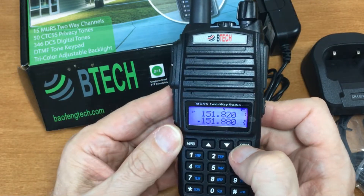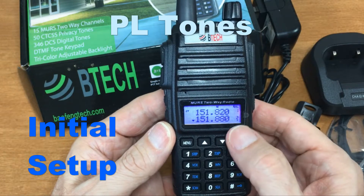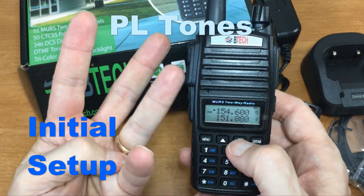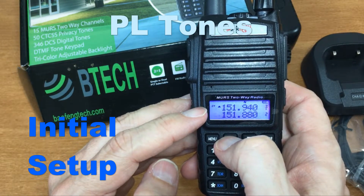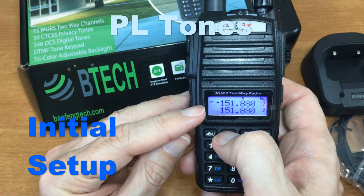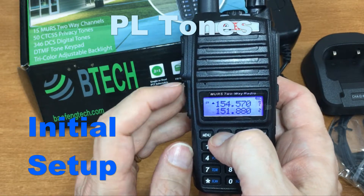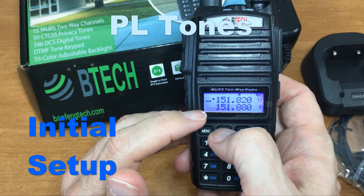Inside the menu you can set it to act as a single push-to-talk, transmitting on whichever line has the arrow. You'll notice a 'CT' indicator. Changing bands, it still shows CT. Scrolling down to channel 15 — that's the last one in three bands of five. You can see DCS on some channels. Going through the bands: CT, CT, CT on band two, then narrow switches to wide on channel nine, still CT, and then DCS on the last set.